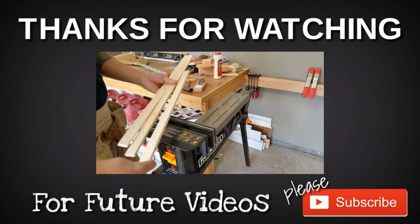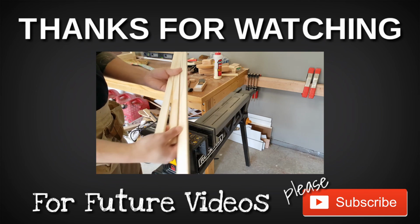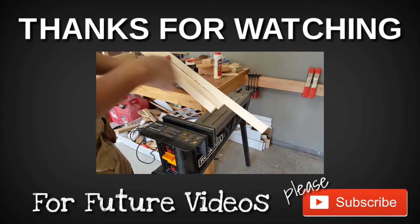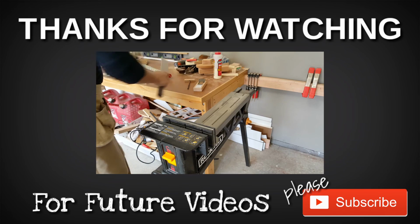Pre-shaping braces. I put the template on, put out all the different braces, and now I'm going to cut them out and just pre-radius them to the 15-foot radius over the back.